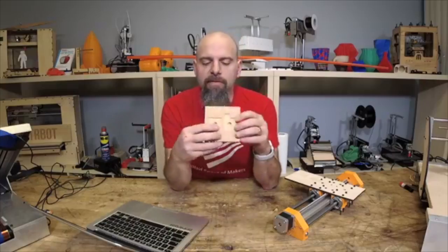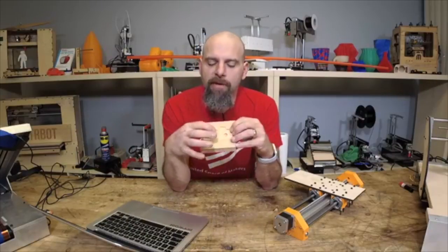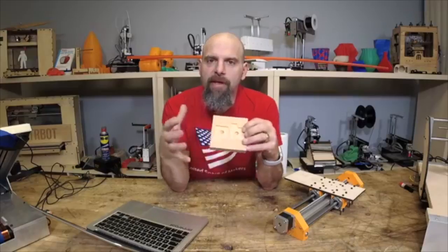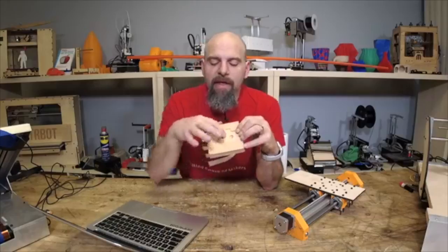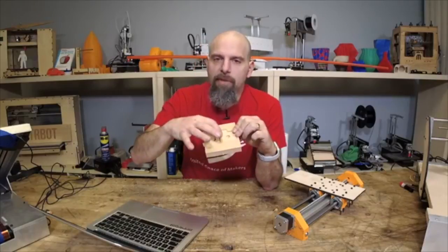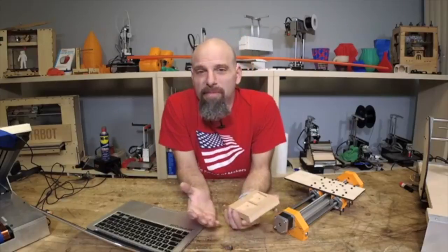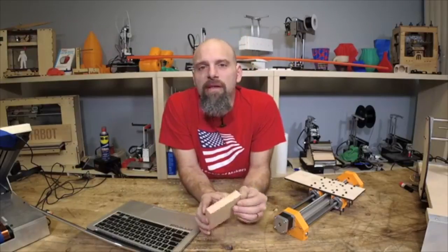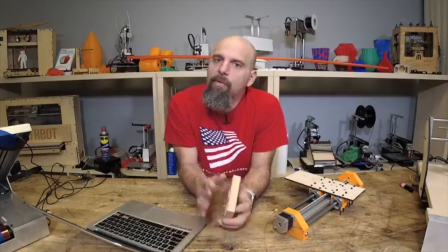And I usually start that paste extruder in the center, like if I had a cupcake or something, I'd put it in the center and then slice it that way. So I can just kind of eye it to be in the center. And then, no homing, you just say print and it'll start printing. So it's really pretty basic. You wouldn't need end stops at all. Therefore, you can use the stock firmware with one exception.